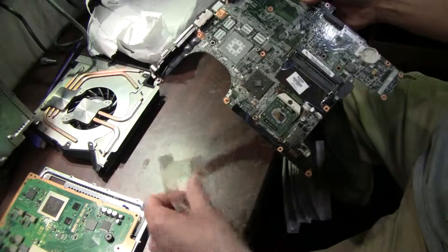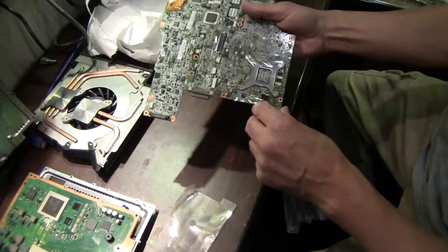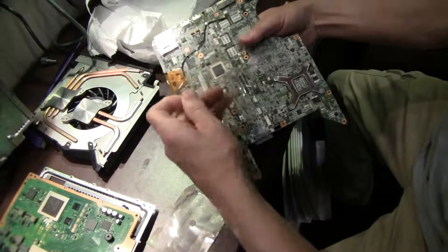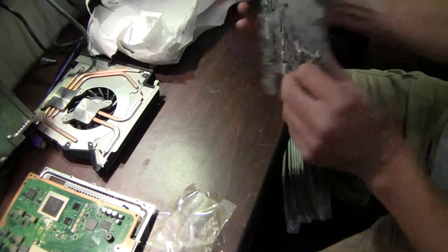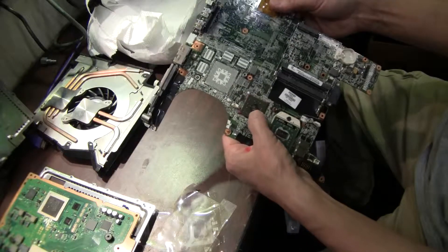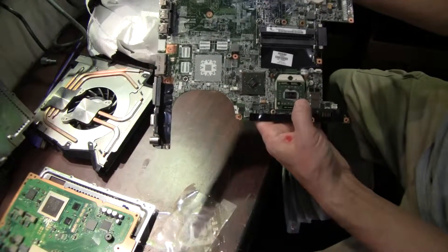This one's very sloppy for some reason, probably because we're doing a video on this one. There's another piece on the back that goes behind the chip clamp on your CPU. So this is your CPU, this is your GPU — we're going to be reflowing this GPU here. It's got the NVIDIA on it. The CPU is socketed.